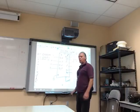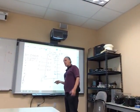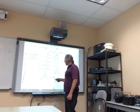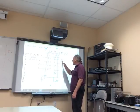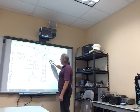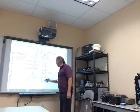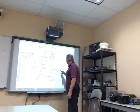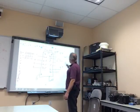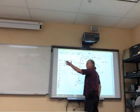And you'll notice there is an L or a load in your data sheets. And that, when I bring it, is it high or low? Has it got a line over it, or is it just open? Just open. That means to take it high. When I take it high, whatever these are connected to, that's what the word will be. Now, what did we connect them all to? Ground. But I could have connected, say, this one right here. I could have taken that one to high, 5 volts, and now I would have had a word 0010. And that would have been what number? 2. So when I do the load, I would expect to see on my display a 2.